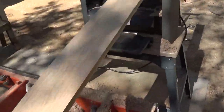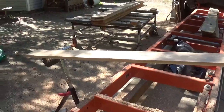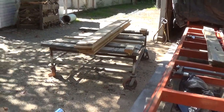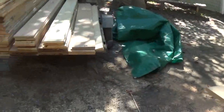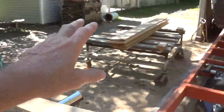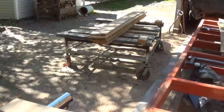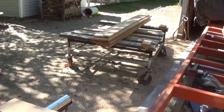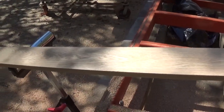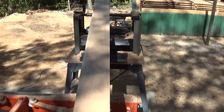This wood will stain up nice — it's just ready to go. That's how you go through the process of getting yourself a three-quarter inch board that's worth something. If you're not willing to do this, throw the pieces that aren't worth anything on the pile and cut them up for firewood. I have about sixty or seventy pieces of wood there. Something like this choice piece is what I like to use for furniture. You can put that white sapwood side face-down on your furniture and hide it.